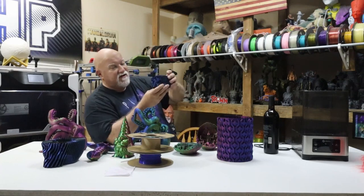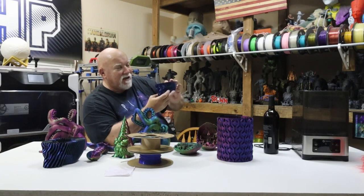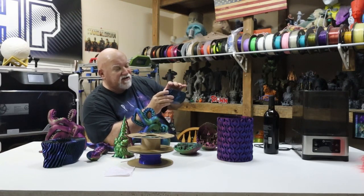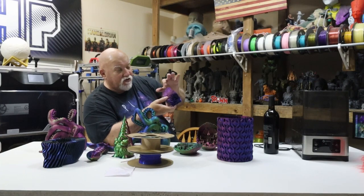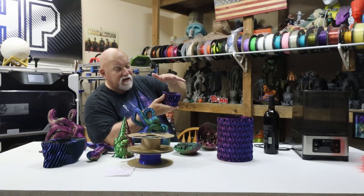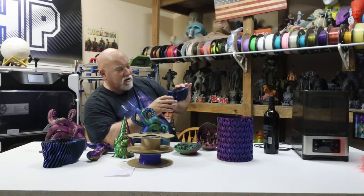So then I went at 100%. I think I ran out of filament — the top never got done, I wound up running out of filament. But this is at 100% with 5% infill, locking all these individual ribs that are separate because the bottom and top infill lock them in. Each one of these splines are separate — they're not touching all the way through the print, so you have to have infill. That was coming out really good but I ran out of filament. It's a nice print — I'll probably keep that around just to talk about and explain what happened.